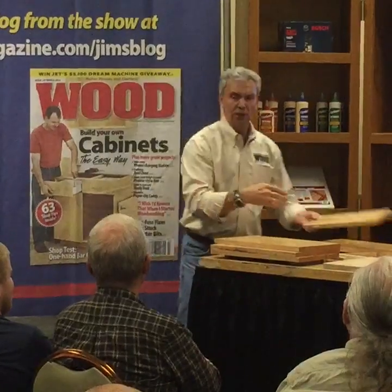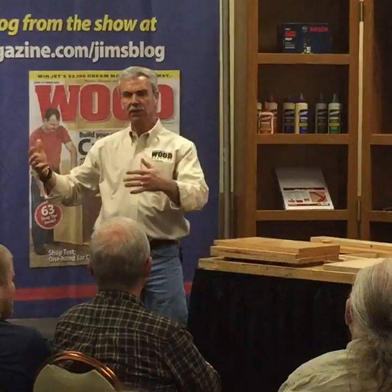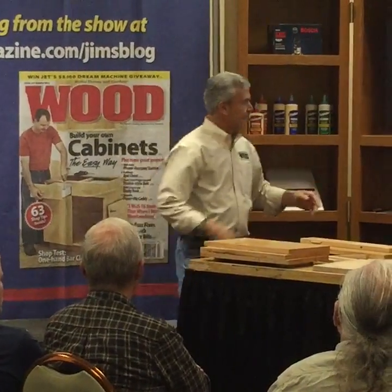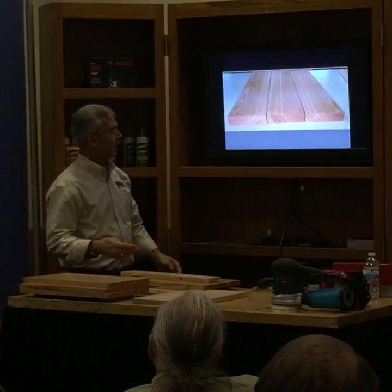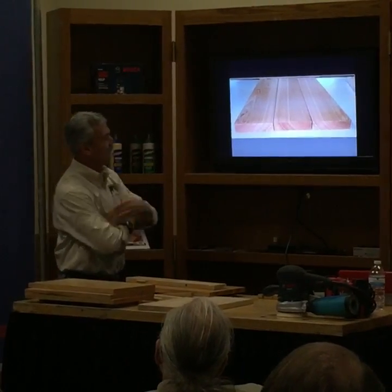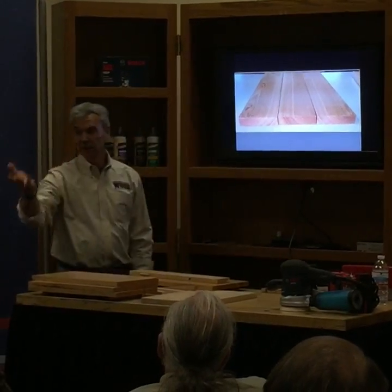Okay? And don't hold me to this. That's not to say you can't use a 4.5 or 3.5 or something, but if you can confine them to about 4 inches wide or so, they're not going to do anything dumb, and you can leave this exactly the way it is. I don't know if you do it now, but I know that everybody did this when they looked at a board and they thought, God, that's perfect. And then, oh no, that's right. I've got to turn this board over to get the grain to go the opposite way.